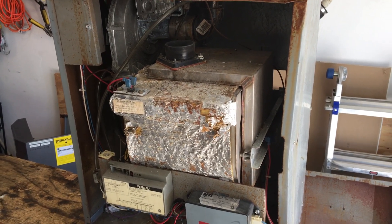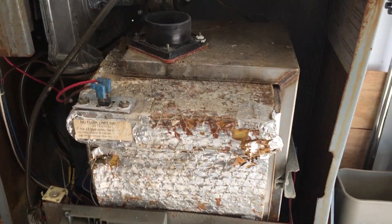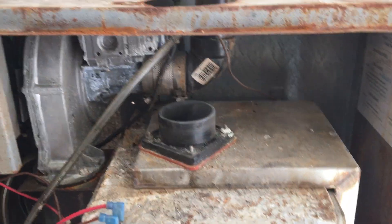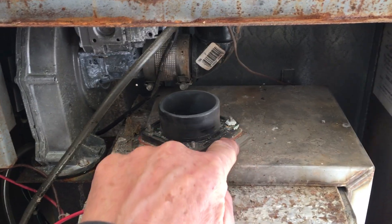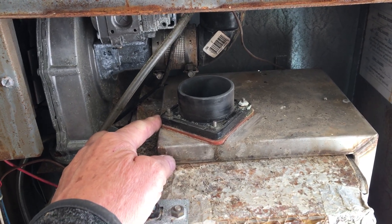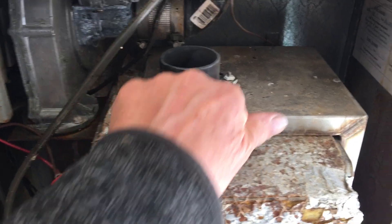The weak points of these T-series boilers — this is first generation — the major problems are corrosion and leakage all over the place down in the bottom. A lot of that is from condensate leaking out, usually from the exhaust port. You can see this one has a gasket in it. Some of the very early models didn't even have a gasket — they just put some sealant on it and screwed it down, and those almost all failed. At some point I did put a gasket in this one, and that helps seal it up. Most leaks were coming from that.